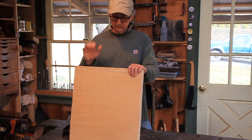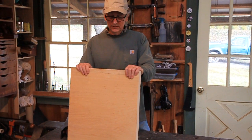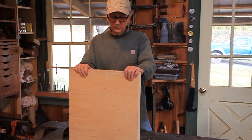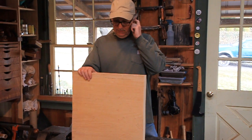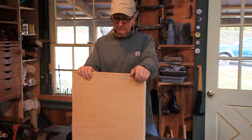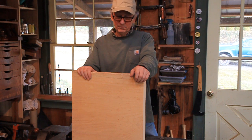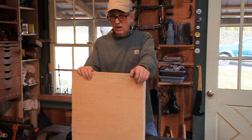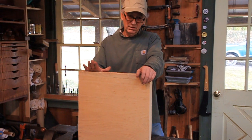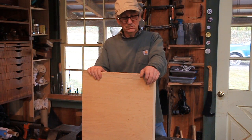You can use any wood that's strong enough — which is most any wood — if you're willing to carve it. Most woods get harder and get tough to carve by hand, but you can do it. Elm's been used for a whole lot of chairs and it's pretty hard stuff. For your first chairs, you might want to look at pine. Tulip poplar is not bad if you get the green heart, air-dried green heart. Get the kiln-dried white sapwood and I'd stay away from it — it's pretty hard.